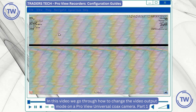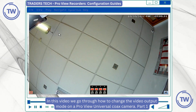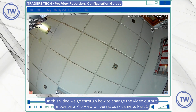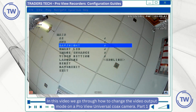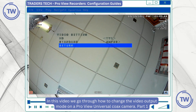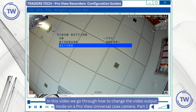The camera has now rebooted and there we go — we can see in the top right hand corner the camera now says it's in TVI mode. I'll just bring up the menu options just to show you, and that's how you change the mode on one of our ProView range of universal coax cameras.